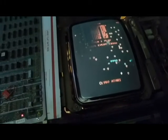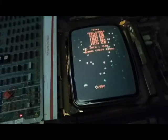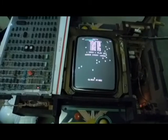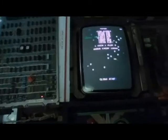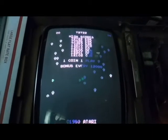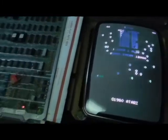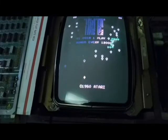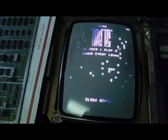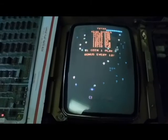It's an LS74 and those aren't too horribly expensive, so it's not really that big of a deal. I'm going to go ahead and get set up to replace that chip. This whole time I've been running the game and that little shakiness has not returned — this whole time I've been running it with that new chip piggybacked on. It's not perfect, but this could be the issue. If it is, that would be a pretty simple little fix. So far it's been running great. We'll bring the board over to the bench, get that IC replaced, give it another test, and see if that was our issue from the get-go.